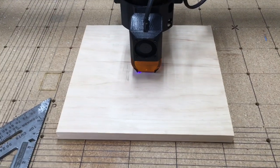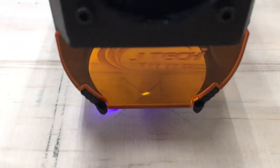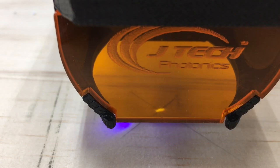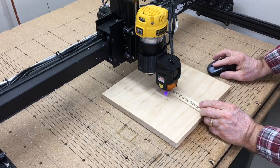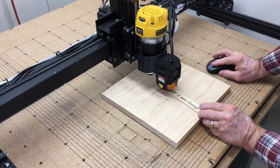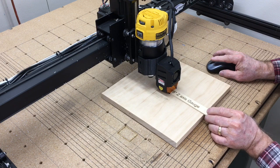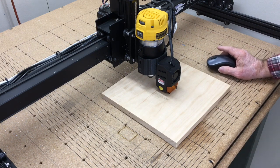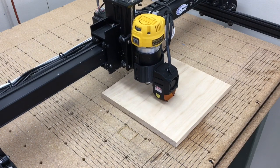For this project I'm using the center point as the center of the wood. I've got my crosshairs there in the center and the laser light is pointing directly at the center point. The next thing I want to do is take my gauge that I made and set the z-axis to 1/8 inch above the work surface that's going to be engraved. I'm moving this down at 0.01 inch at a time and I want the gauge to just barely touch the surface, and then I'm ready to start the engraving.